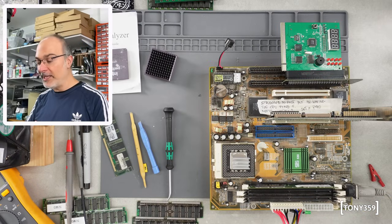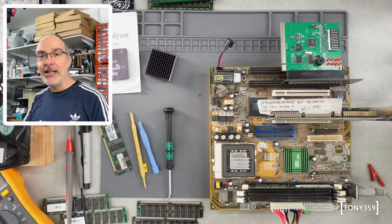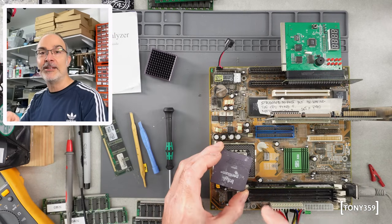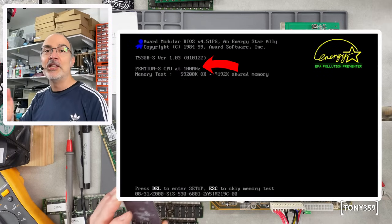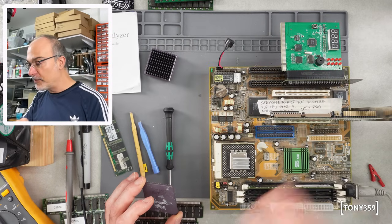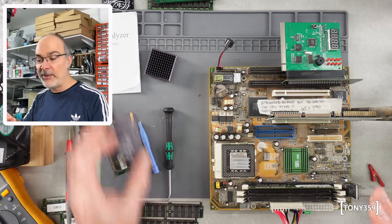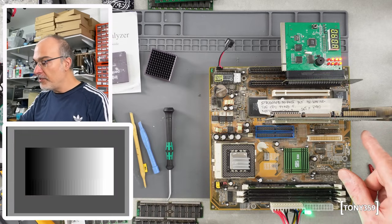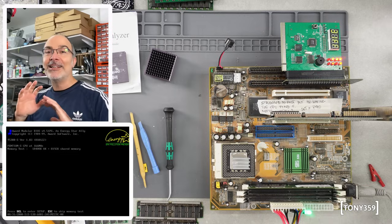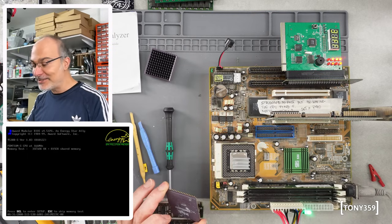It's the following day. I came back to the workshop and took another look at the Socket 7. I realized this board doesn't support 60MHz as a base bus, so I was running the poor Pentium 90MHz at 100MHz — and you were probably screaming at the screen. That's why it was intermittently working. The Millennium had other issues too, but that's why it refused to work with PCI. I've now put a Pentium 166MHz non-MMX on it and it's working totally fine — posts every single time. Sorry I didn't notice the screen said Pentium 100 when this was a Pentium 90.